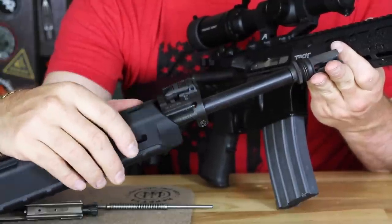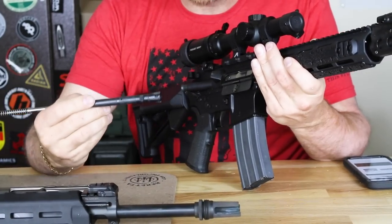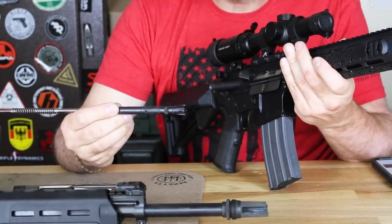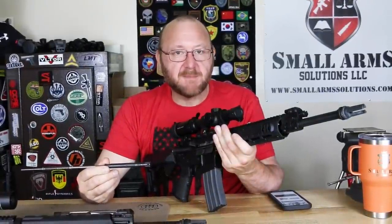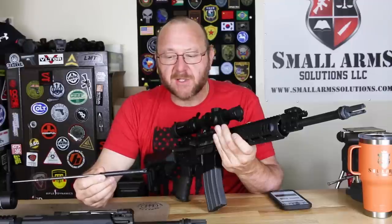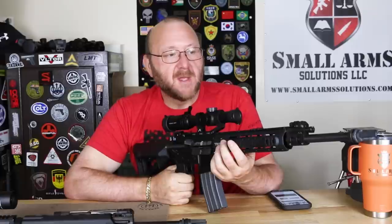The other thing that I didn't particularly care about was the way you had your adjustments. Your adjustments on here did not have any way to identify which one it was, so you really had to look to see which position you were on. So I said to him, the two changes that I would make, I would have you drill and pin your front sight base, your gas block, and put some kind of a marking on your regulator to show you what position you're in.